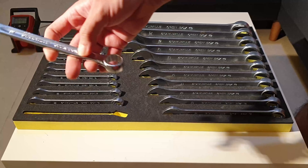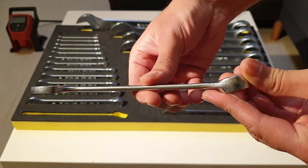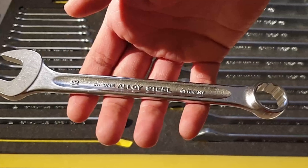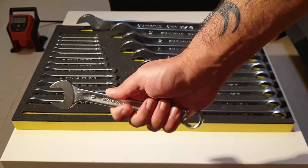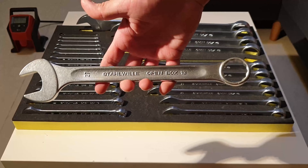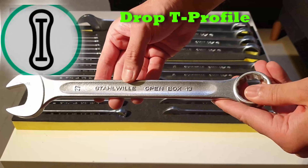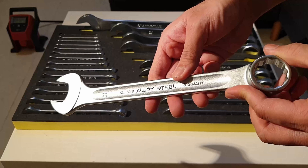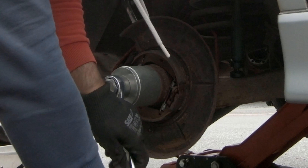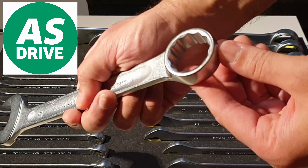Let's pick up another one — a beautifully finished wrench. It's number 18, and look at the thickness, pretty thin. I'm really impressed with the craftsmanship. Both the box end and the open end are nicely broached. It feels light but good in hands. That's number 27 — it's a huge wrench but again does not feel much weight. These are strong as hell. These wrenches have a concave shape, which is why they are light — the inner part has less metal, but it does not compromise on strength because you put force vertically where real strength matters.